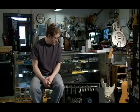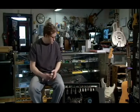There's a lot of other Class A amps. I think a lot of the early Gibson amps are Class A, and I think the Fender Champ amp is an example of a Class A amp. But the difference between a Class A and a Class AB amp, there's going to be a sound difference that we can hear. It's also going to allow us to push the power tubes a little harder and get some power amp breakup, some distortion in the power amp section, and kind of a juicier overall sound at a lower volume. So it's just a neat little widget that you can use to really get some different sounds out of a single amp.